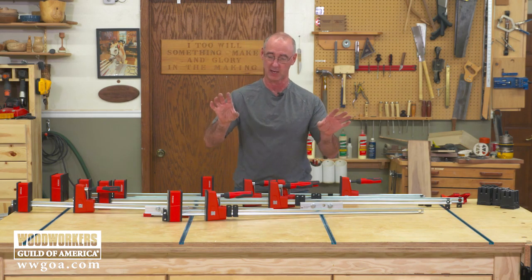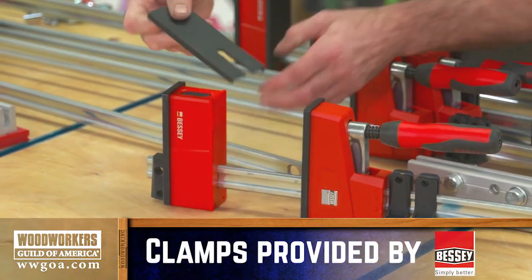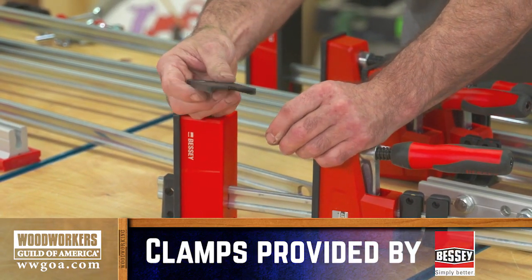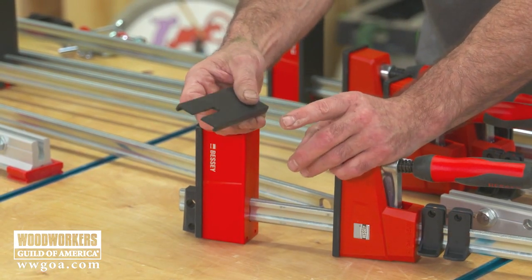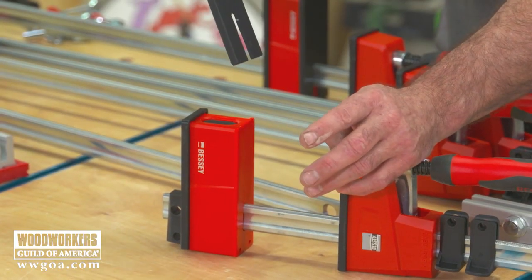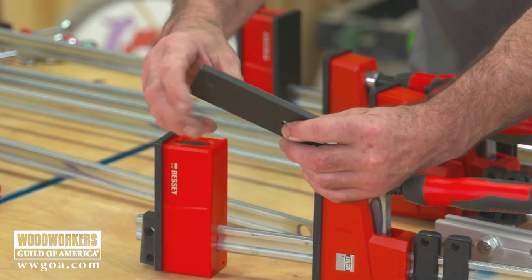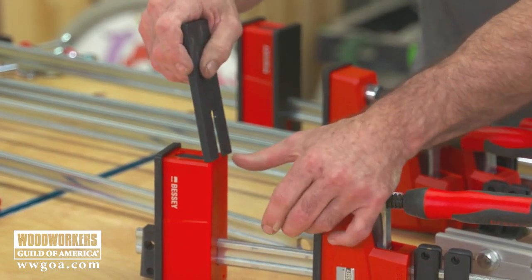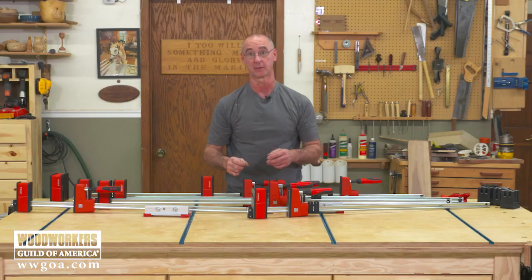So, one parallel jaw — we've talked about that. What's neat is this jaw pad comes off and it's a flexible material. So if I'm doing a glue-up where glue squeezes out and gets on this, don't mess with it — let it dry. After the glue is dry, you can slide this off, flex it a little bit, and the glue is going to pop right off because it's rigid and this is flexible. So that thing is clean again. And of course, if anything happens to it, we can slide that off and replace it.